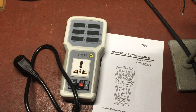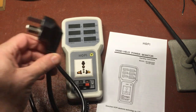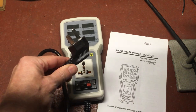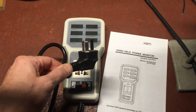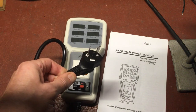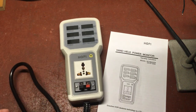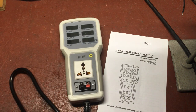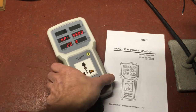Obviously you can run any light off it and find out what its current consumption is, what the power factor is, and what your mains voltage and frequency is. The unit I received came with a Chinese plug of the Australian pattern, and as you'll note, the live and neutral pins are not sleeved, which is not compliant — but I'm not bothered by that.